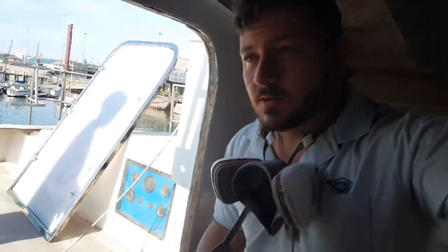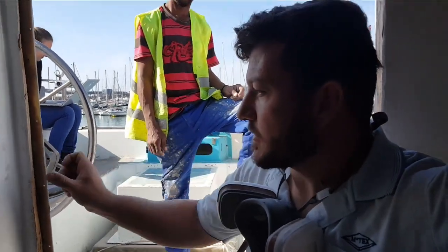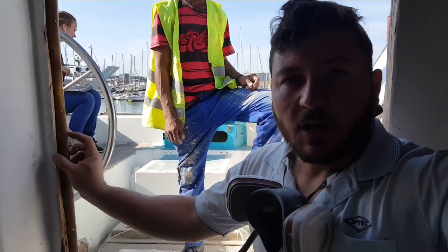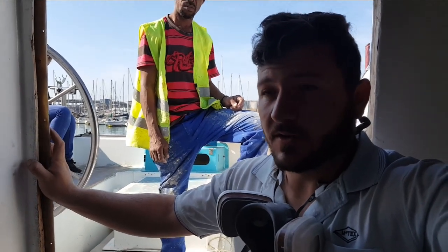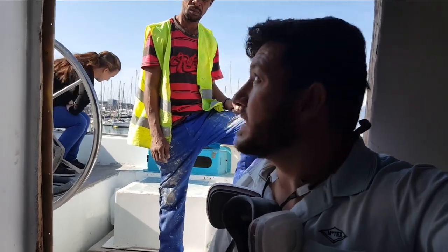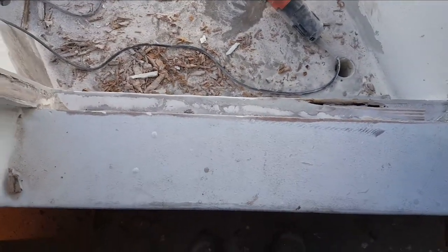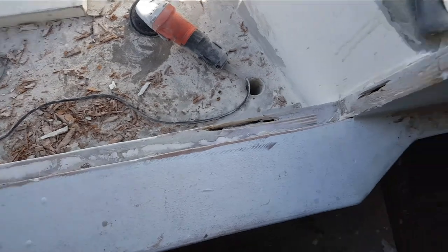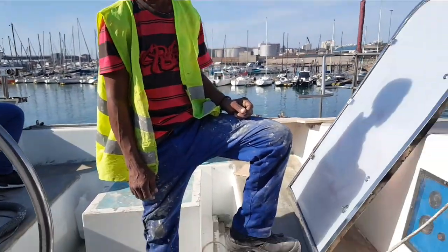Put a weather seal in it and get down to it - get that baby fitting flush. What I just finished doing is grinding out this edge. There's a little bit of damage and I want to get right up to the fiberglass shell. I'm going to do a build-up here with ultra bond - super tough stuff. When that stuff dries you can't break it off, it's really really strong. So build it up there, make a nice solid edge, seal it off completely from the wood, run it right around. Here on the base I did the same - I ran a solid piece over there flat, filled up that gap on the edge. The rest of this wood is in really good shape, so I'll just skim a layer over that and get it all nice and secure so our frame can come back in.